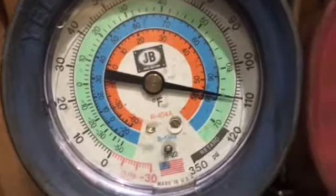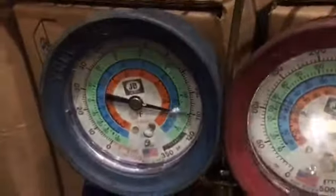If not, I'm going to go to my local supply store and pick one up. I have the system under a pressure test — I have about 110 psig. Let's check if the new CPR valve is holding.